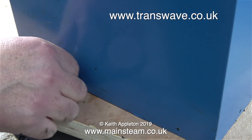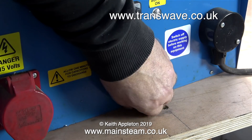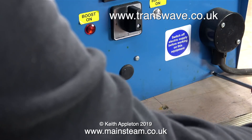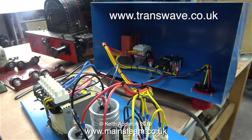Before I go any further I'd just like to say that all I'm doing is going inside this unit to have a look at the components, so I'm not going to explain the theory of operation — if you want to know that, just google it. On the front of the unit printed on a yellow label it says allow one minute for capacitors to discharge, and that's always a good thing to do because capacitors will hold the charge even when the unit isn't plugged into the mains. Needless to say I've unplugged the unit from the mains entirely.